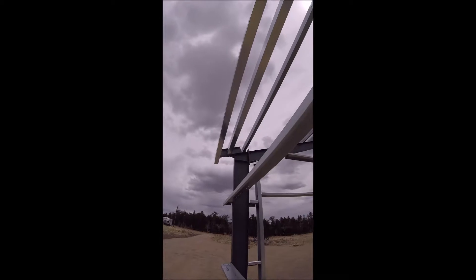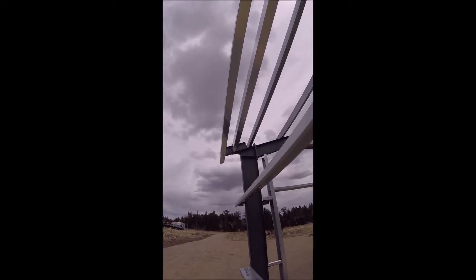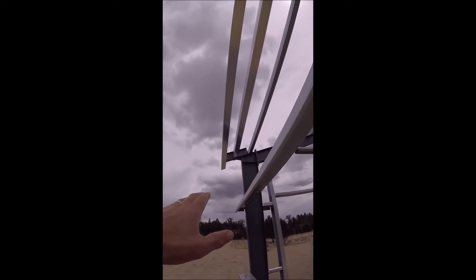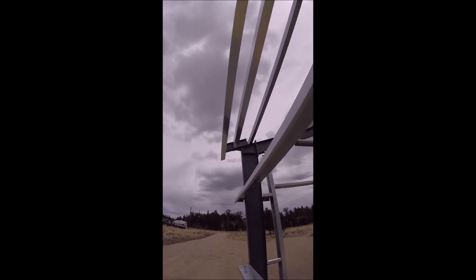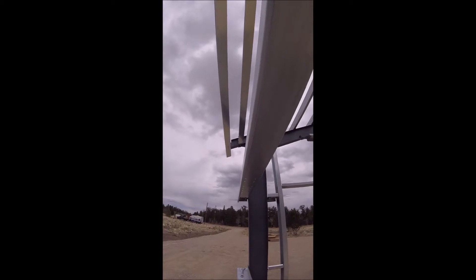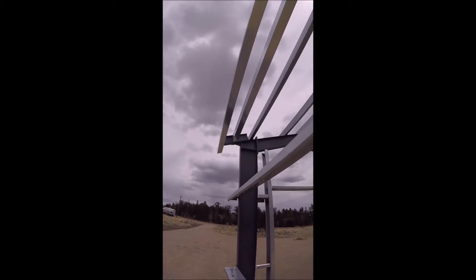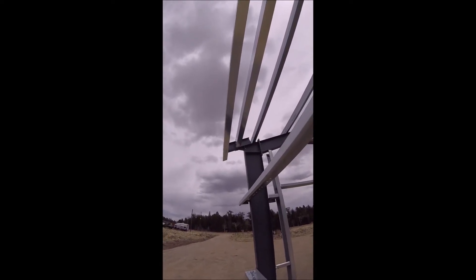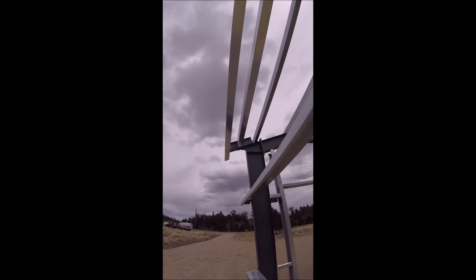The answer is: it's a complicated system. What we're looking at here is the corner piece — the piece on top of the column — and the heavy gray iron that comes down is made by hand. It can't be auto-welded. It's usually an eight-and-a-quarter, which is a different measurement than a W8, and it has four, five, or six clips welded onto it. It's totally made by hand and it's expensive — we're paying eighty, ninety, a hundred dollars for one of these depending on the length, and that's just the labor, not even the steel.